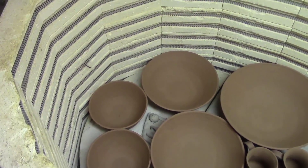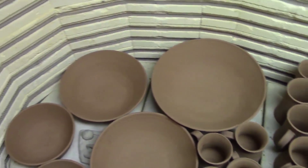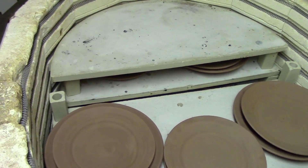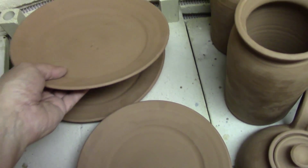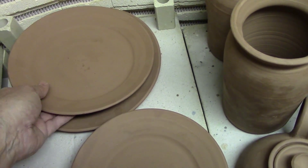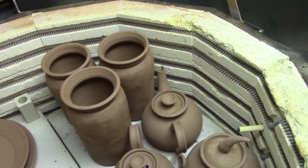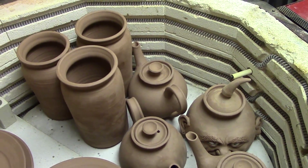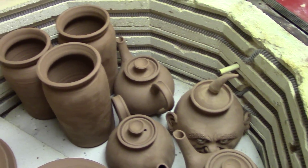This is the second shelf load in the kiln. You can see we can mix bowls, mugs, different sizes, and we'll just keep filling it up until it's absolutely full and it'll be time to fire. As we get closer to the top, we've got plates hiding in there — we can stack them fairly closely. Sometimes we'll stack plates; we just make sure there's a chip between so they both can shrink at their own rate. Vases have to go in — we usually put them in the end closest to the thermocouples.